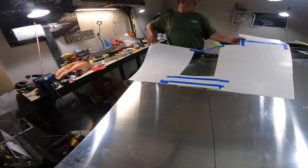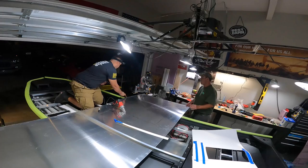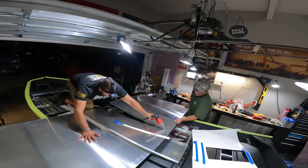The reason we use 090 aluminum sheeting is because that's the same material that the track system is made from. So if you attach the lid to the framing and then the aluminum sheeting 0.090 in all the other areas that you need to deck, then you're gonna have a completely flat deck. There will not be a high spot or a low spot. It's all gonna be flush.